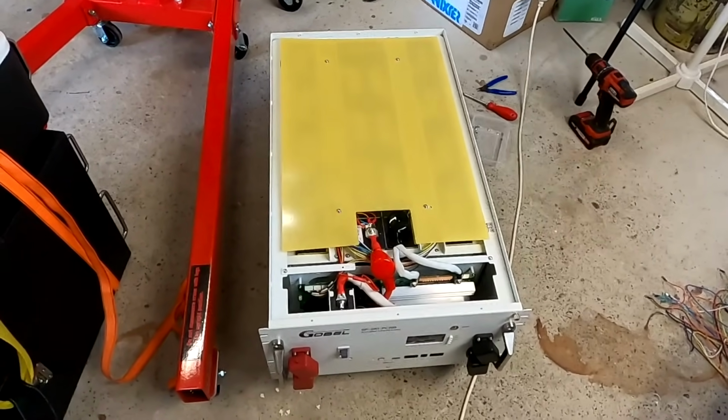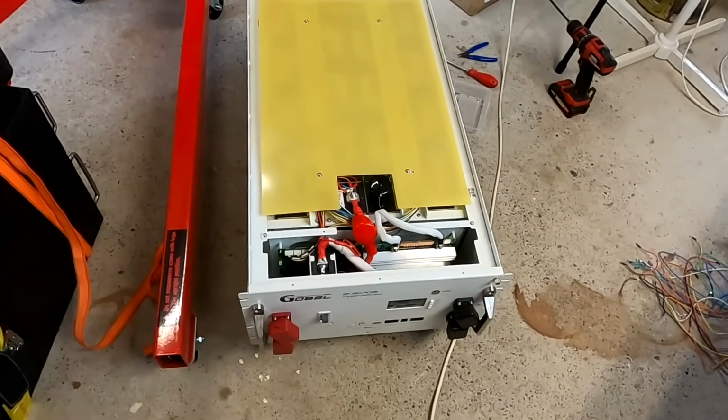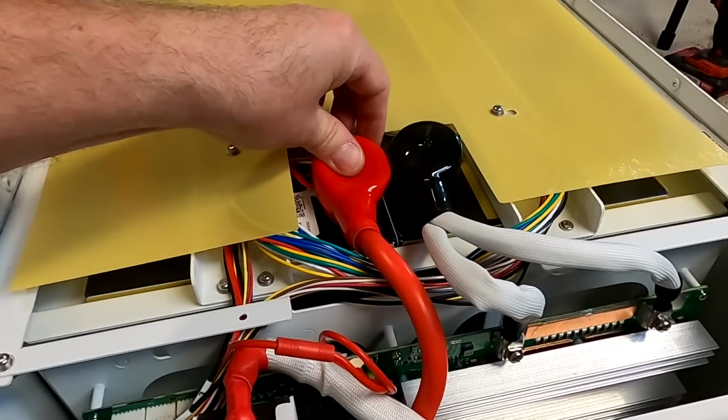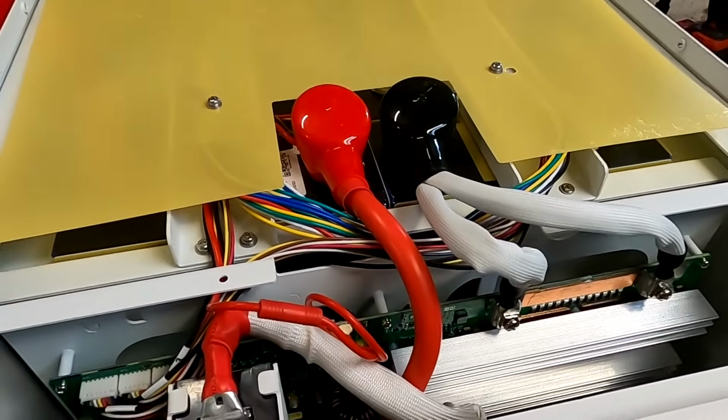All right, my friends, everything has been put together again. Everything is connected, installed. A small but important update. You can also see the lights there, a red and a blue one. Red means alarm because we haven't connected to the BMS yet, and maybe there are some settings wrong, you know. Probably the cell count, because this is the 24S active balancer.